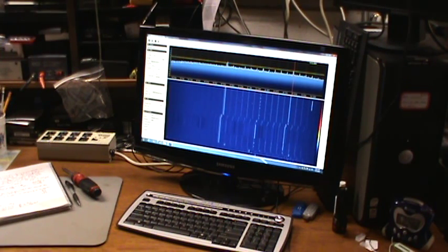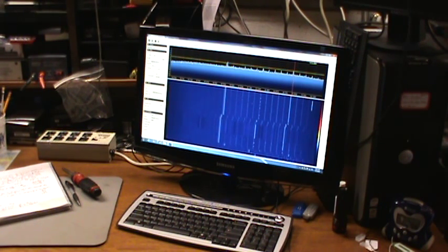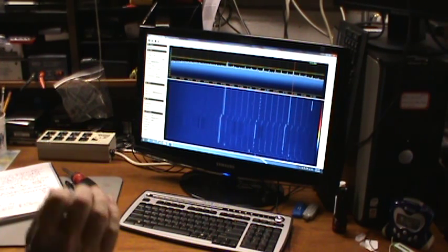Those NOAA weather station antennas are, I'm guessing, about 35 miles from me, line of sight, so I've got a pretty good location to pick those up. I was mainly using those frequencies because they're broadcast continuously. You've got a signal there all the time, so it's easy to compare antennas, unlike a signal that's there for a while and then not there for a long time. That's why I used it, even though they were not good frequencies for the HDTV antenna's preamplifier.